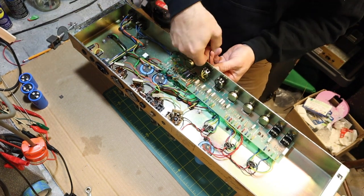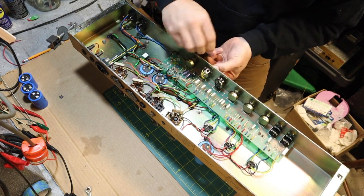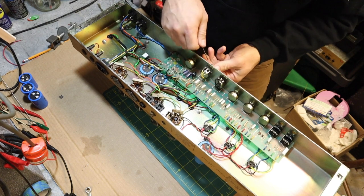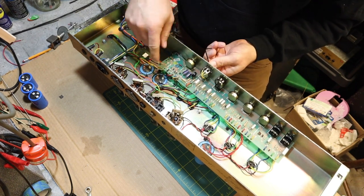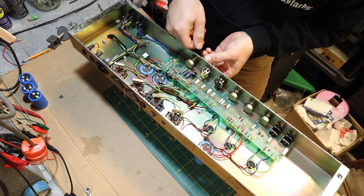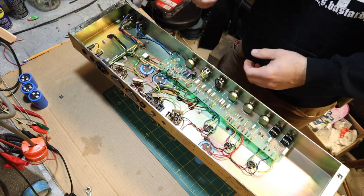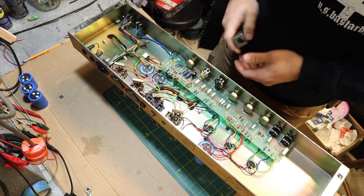So you notice I've gone straight for pulling the circuit board. I haven't even checked anything yet. My reason behind this is because with caps that are this old, I mean, these are original to the amp from 1988, the dielectric compound within the electrolytic goes bad. It just dries out over time. If I replace the fuse and get it running, the caps don't last forever. And plus, I'm not going to waste time trying to troubleshoot something that I know should be fixed anyway.